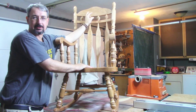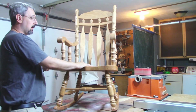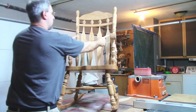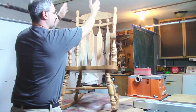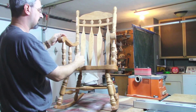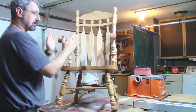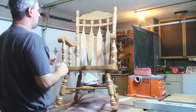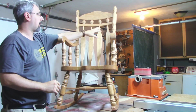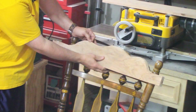The top piece that I was mentioning, it was altered from the original design. And the reason was, on my design, the back two spindles are more vertical on my piece. And it wasn't done like that on purpose. I just didn't drill out the angle holes on the chair for these pieces, right? They should have been flared out a little bit more. And so when I went to fit the old piece in, or the copied piece in, it didn't fit. It actually stuck out to about right here, a couple inches past.